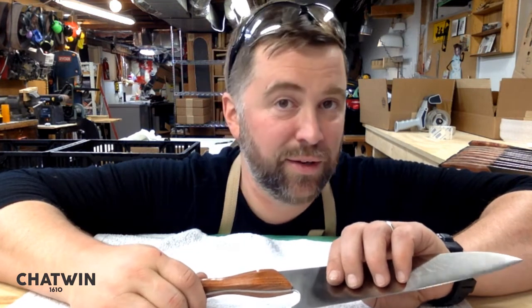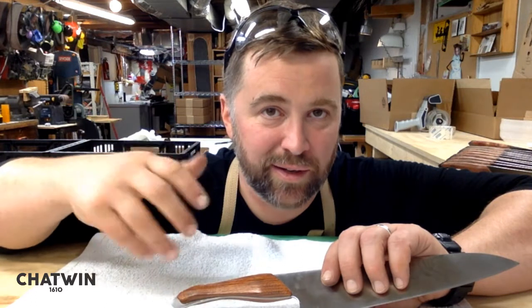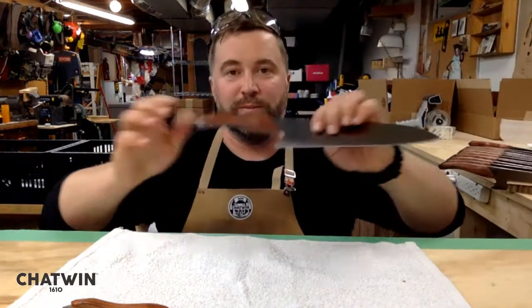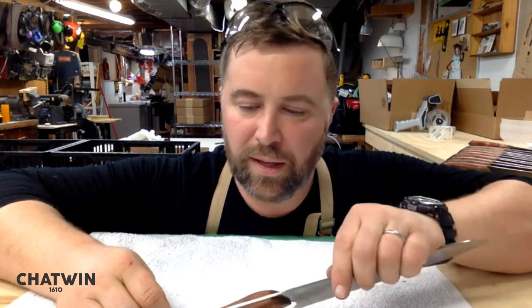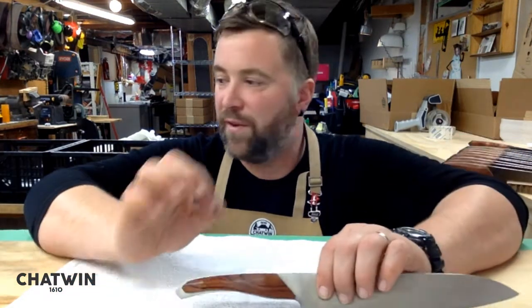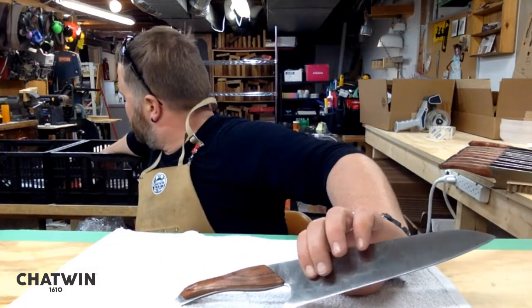If you really want to saturate or stabilize the wood, which is not really needed, you can put it in a jar, put that in a vacuum, and put some resin in it that'll fill the air gaps. But that's completely overkill. One thing I've experimented with is super glue, which is another thing that works reasonably well. It seals it, but there's the hazard of gluing your hands together. This is a very runny, not a gel, but very liquid super glue that I use.